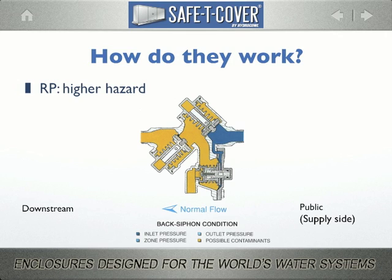Well, some think that that event defines the limit of what water can ever flow into a drain, but that's just not so. If you look closely, you can see that a small pebble has lodged in the number 2 check valve. Because the number 2 check valve is not closing, water will continue to flow out of the relief valve until the private lines are cleared. Now, if this is a 4-story building, that's a lot of water.